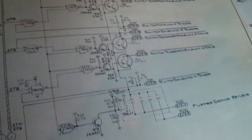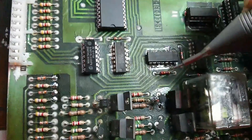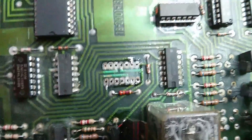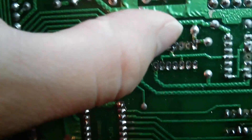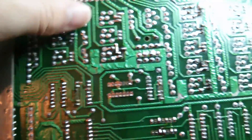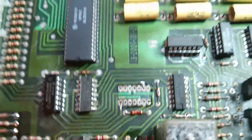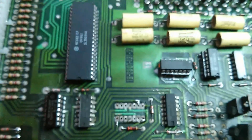What we need to do now is look at the schematics — we basically need to look for IC9, which I think is this one here. I've identified IC9 as potentially bad and removed it. One of the issues is there's actually a lot of corrosion under here that needs cleaning up. Also, the previous person to change this IC has ripped up a couple of the tracks, so we've got to deal with that as well. Someone's been hacking away with a soldering iron. This is a 7402 — I'm going to test that out first; I suspect it is bad.